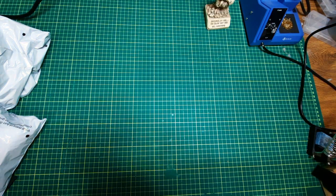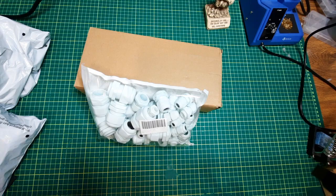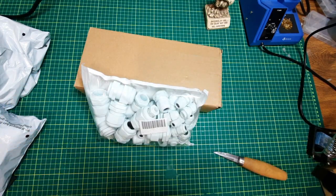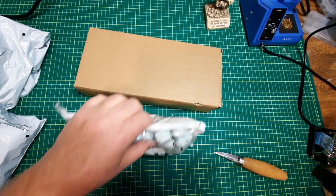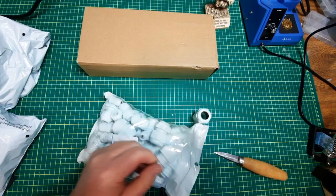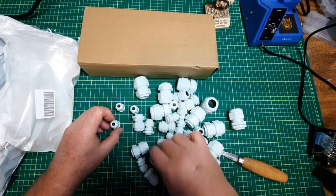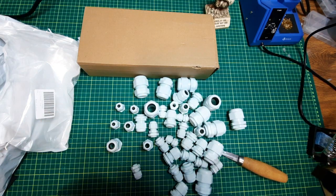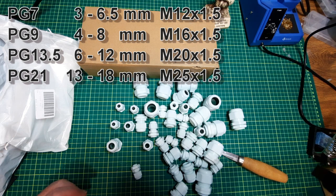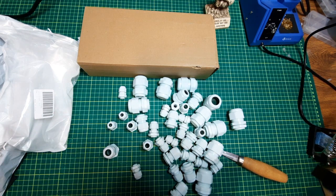Box number one out of one. Box container number two. And the airbags. So these are glands — cable glands. Got a variety of sizes here. Hopefully one of the sizes will fit. They are PG7, PG9, PG13.5, and PG21. So this assortment should go from 3mm up to 16mm. I'm going to bet that's the 3mm one there. I'll show you where I'll be using these shortly.